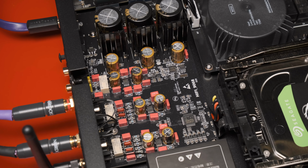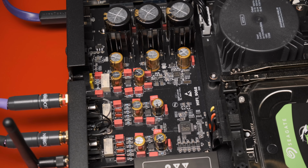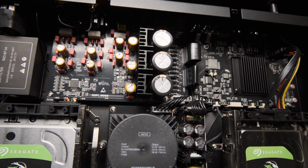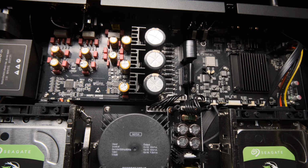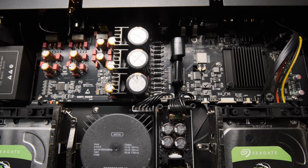And hand-picked audiophile components from Elna, Nichicon, Wima are everywhere here. As I said at the beginning, this DAC can handle just about any digital audio format and resolution imaginable. And what's more interesting, this DAC has two femto clocks, one for frequencies that are multiples of 44.1 kHz, the second one is for 48 kHz. Pretty impressive for a video player, isn't it?